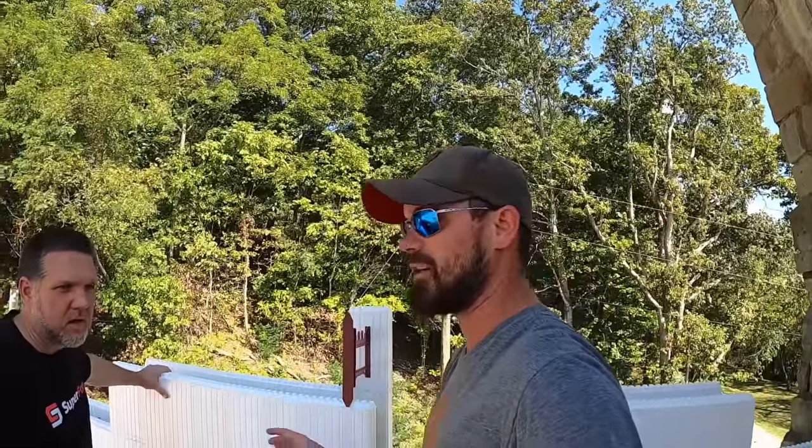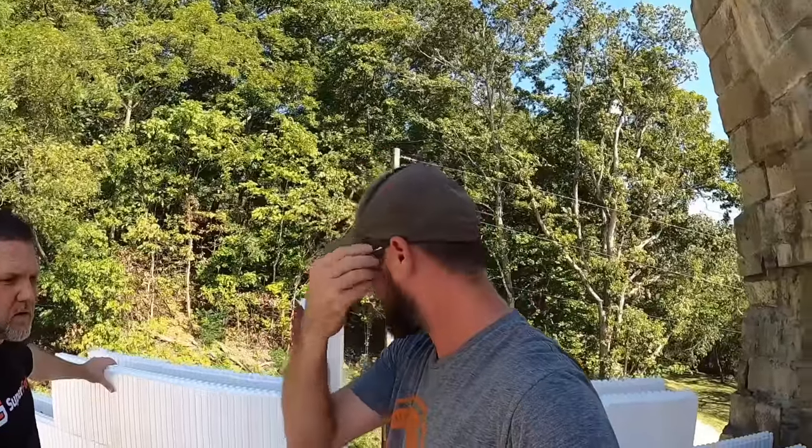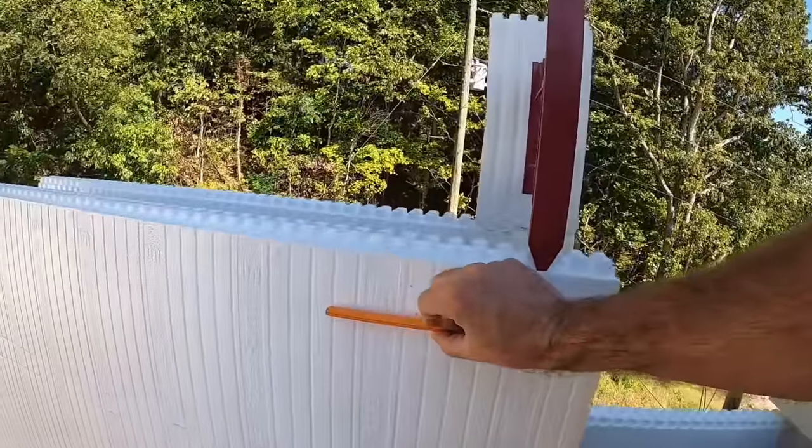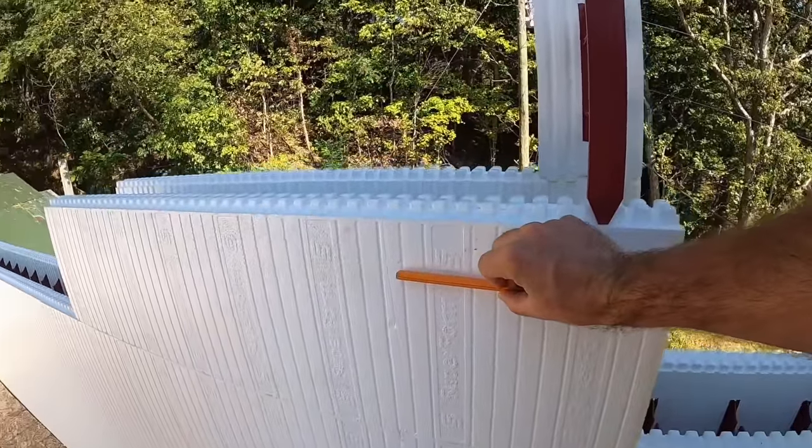do the electrical here, as to how you make sure your chainsaw doesn't hit concrete, and how you make sure you're the proper depth for your wire to tuck in there really nice. I did have a pencil. This is a better explanation. So this is the width of the 12-2. That's the thickness. Essentially, you're shoving it in the wall like this after you cut a groove in it. That's all you're doing. Right.